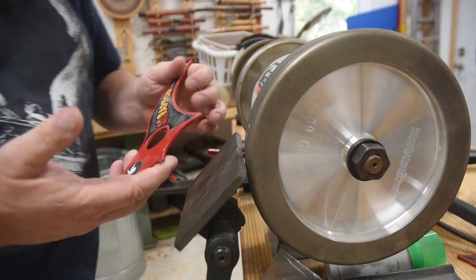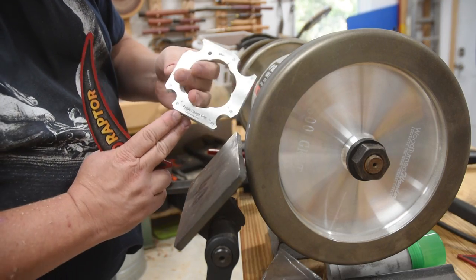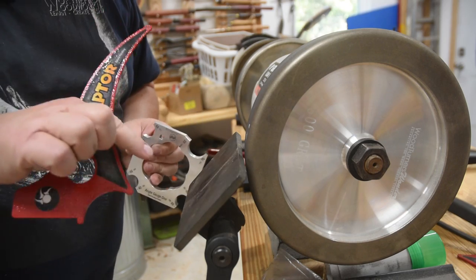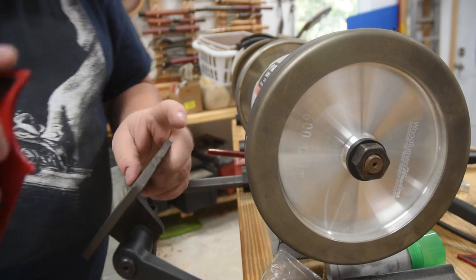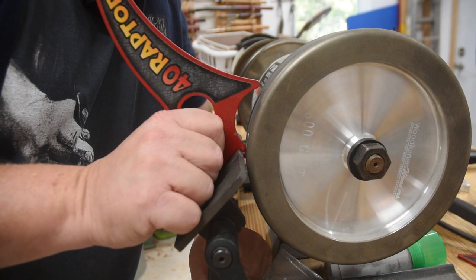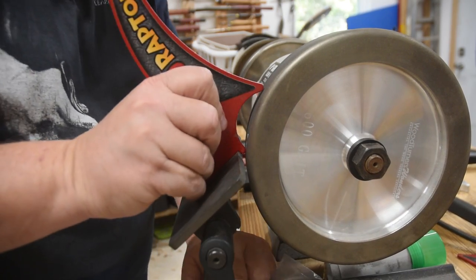If you don't want to do that DIY approach, there are companies that make really cool jigs. I personally like this Raptor — that's one Dad bought. I got something from Stuart Batty Design back when he was marketing them; I think he sold the design to somebody else. It has all these different angles on it for setting up. I didn't like it, but Dad loves it. He doesn't like the Raptor, but I do. The Raptor is about $12. How it works: there's a little lip on the edge, you drop it down on the platform, move your platform to the distance you want from the wheel, change the angle until both tips touch, lock everything down, and you can return to that setting time and again.